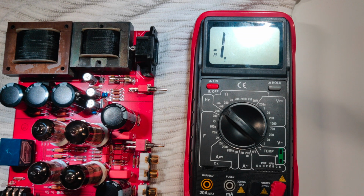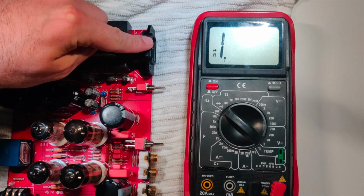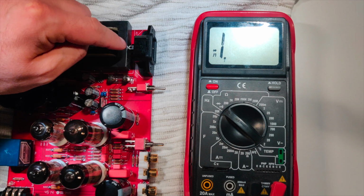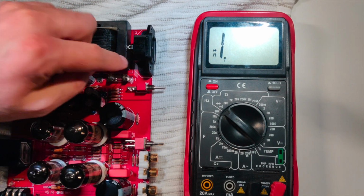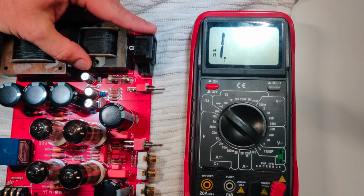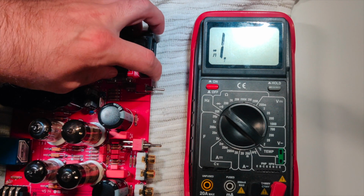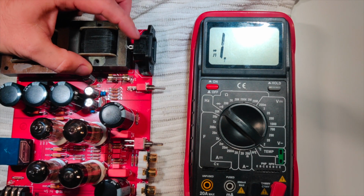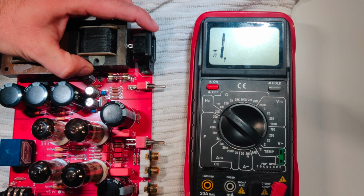So let's find out. I actually have had a really hard time reproducing this, but now I'm going to apply some stress to this plug here. I'm going to change the camera so I can show you my oscilloscope screen, and we're going to play around with this point right here. You can see how much this is flopping around. Generally this won't be flopping around in the breeze like this because it's held in place with screws against the chassis, but given enough thermomechanical stress, I can see this intermittently bouncing here and causing a problem.